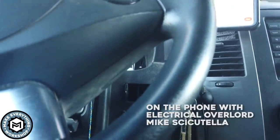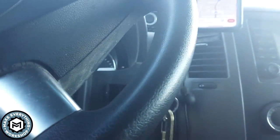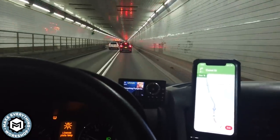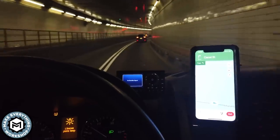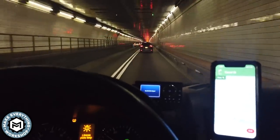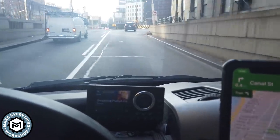Okay, what's going on? So it has no cord — it's three phase and it has no cord. What kind of cord do I buy? I forgot. SJOO? SWO? It's five horsepower, three phase. So it's probably the same size as the SawStop. Three phase, five horsepower. Well, I hope the thing works, cause I wasn't able to see it powered up. He didn't have a cord on it. That's a bold move. Yeah, sight unseen. Taking risks. He said it worked when they bought it. Five horsepower, 208 volts at 16.7 amps. Okay, so 10-4-SJOW. Let me know if you have any other questions.